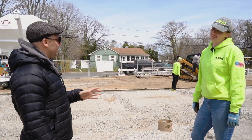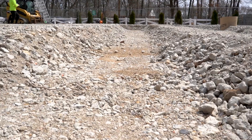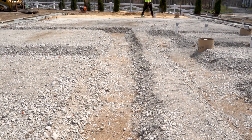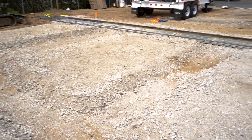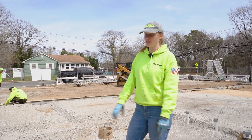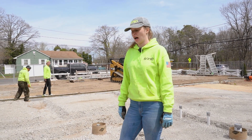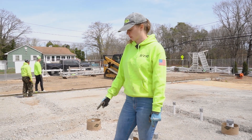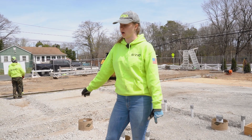I've built a lot of houses — this is the most beautiful site I've ever seen. It's meticulously put together. The way you guys put the RCA, everything's tamped down. Rather than doing just a traditional uniform-thickness slab, we actually have haunches in this design to make sure all the interior non-load-bearing walls are really well supported, so the slab is a bit thicker under those areas and then just normal thickness throughout the rest of it. That's for extra support since we're going to be digging out the footings and foundation walls for the exterior walls, but for the interior walls we do the haunches instead.